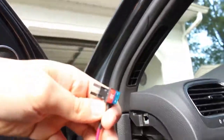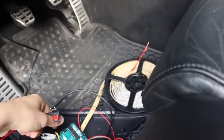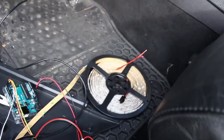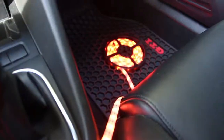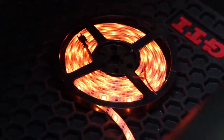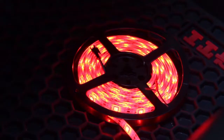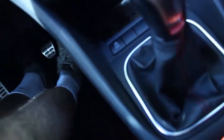I have my ground connected to a bolt, the step-down plugged in, the fuse ready to go, and power coming out of the step-down to my LEDs. I already have a sketch uploaded on the Arduino that runs through all those LEDs. I went ahead and plugged it in — and I got them all lit up! It's 150 LEDs. The color changing looks a bit delayed, but at least I got the power working.